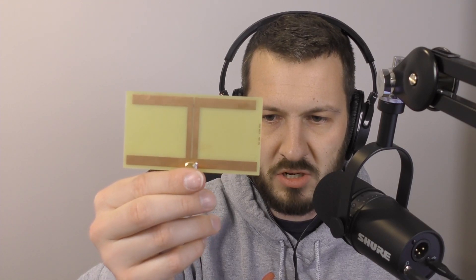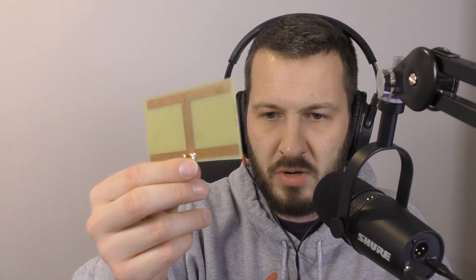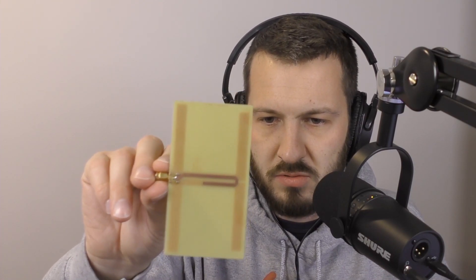Those are the WA5VJB antennas. Now for some other interesting antennas — those were log periodics, but I've also got some PCB Yagis. When I bought my SGLabs transverters — I've got videos on those on my channel too — I got these PCB Yagis that come standard with the transverters. This is a 1.2 GHz two-element Yagi, just a simple PCB. The idea is you screw this into the transverter and point it where you want — an effective little two-element Yagi.